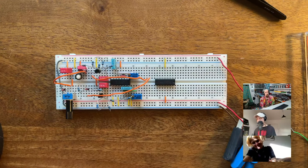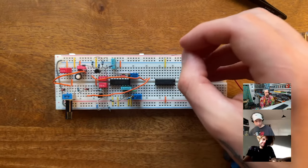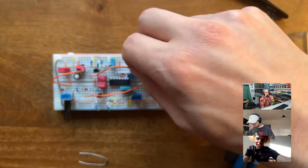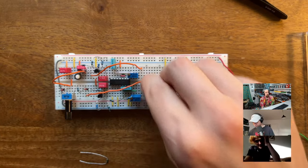But in all seriousness, they're handy because they're non-polarized, so you don't have to worry about which way you put them in. And in general, if you put them in series with the signal, they don't care that the charge is shifting left and right. Whereas electrolytic capacitors can explode, I think. It never happened to me, but I heard that they can explode if you abuse them. Basically, if you apply too much voltage. It happened only once. Happened to you? Yeah. But yeah, it's just too much voltage. Right.